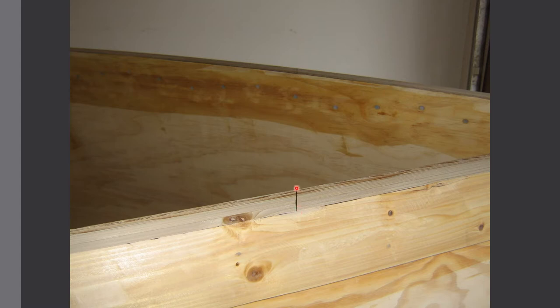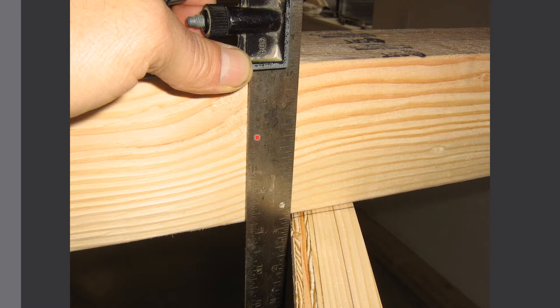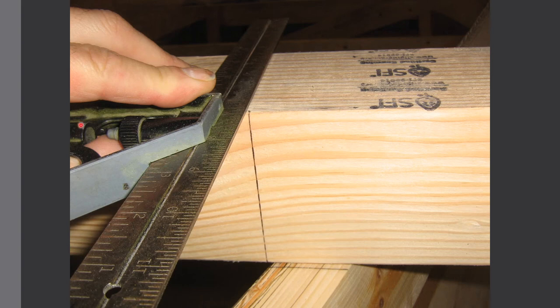The goal is to install that 4x4 timber right across here, with its top face flush with the chines and centered on those marks. Begin by laying a 4x4 of sufficient length across the boat and place its forward face even with those marks. Slide your combination square along the top face of the 4x4 until its 90-degree edge just touches the inside edge of the chine, and make a mark along this side of the rule. Without moving the 4x4, make a similar mark on the other end. Next, use the square to transfer this line across the top face of the 4x4.